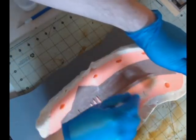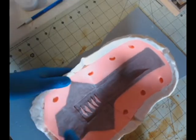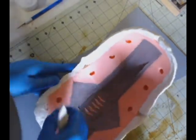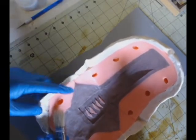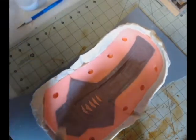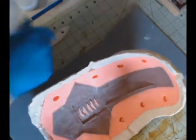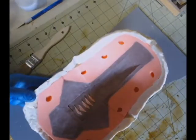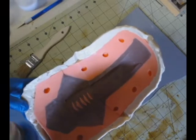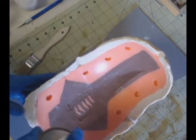All I'm doing here is using a clean bristle brush to get any little bits of residue that may have come off during the demolding process. And you can see that I also have the actual clay mold still in the silicone. Now, full disclosure on that, it did not come off the helmet when I pulled the silicone mold off. I had to actually cut it off of the helmet, and it came off in two parts. It didn't come off easy, didn't want to. Then I put it back in the mold and put it back together. I had to do some reconstitution of some of those lines and a little more work on it. You can see how I hollowed out the center, so that's an air channel. There's an actual fan that fits inside there. What I'm going to do now is spray it down with mold release so that we can start pouring the silicone in here to make the other half of our mold.